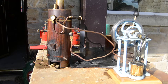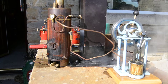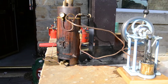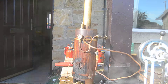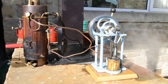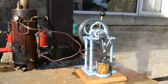So as you can see, on gas this boiler is quite capable of increasing pressure up to 60 — maybe more than 60 pounds — running a 1-inch bore engine with just over a 1-inch stroke at a reasonably high speed, probably 200 to 300 RPM, and it can still happily maintain that. With enough water trickling in gently and sufficient gas, I'm sure it would maintain steady running. The engine is relatively powerful — you'd be surprised. Particularly if you've got about 60 or 70 pounds pressure, it can give a nasty kick.